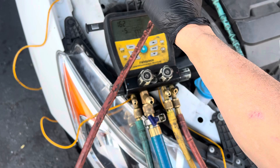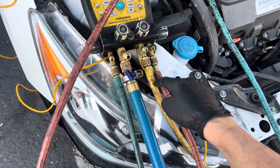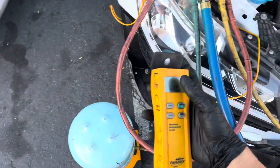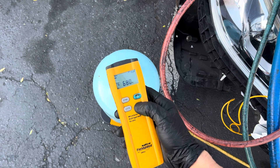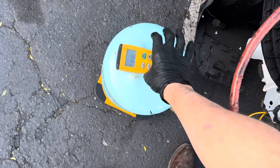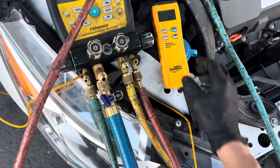It's on the vacuum. I have the low side shut off, I have the liquid side line refrigerant filled up with liquid refrigerant — it's closed off right here. We're at the tank, we have our Field Piece trusty Bluetooth scale. Let me zero it out — there we go, zeroed out. Let's make sure everything works, and it is working. Does it zero back out? And it zeros back out, so we're good right there.